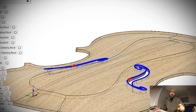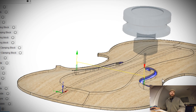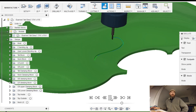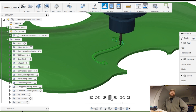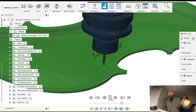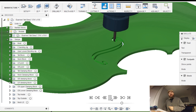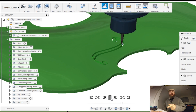I'm doing a negative 0.2-inch axial offset, and that's just the bottom dimension of this cut. I'm doing passes at 30 thousandths of an inch — going to do six of those — and that's pretty much it for the operation. I'll show you the simulation really quick: it's pretty straightforward — just an outline pass, six step-downs — and that's what it is. I'm going to get this post-processed, set up the machine, and we're going to cut these.